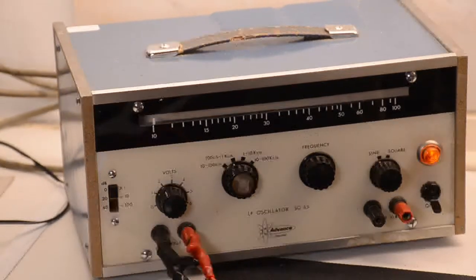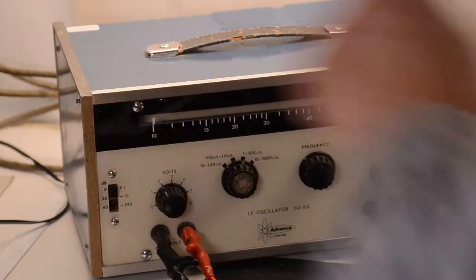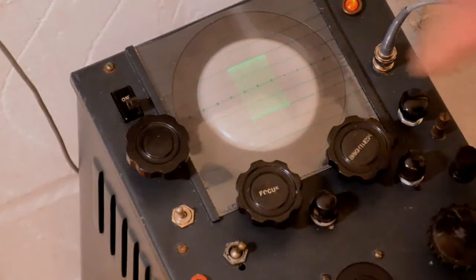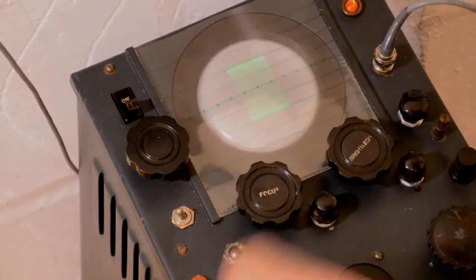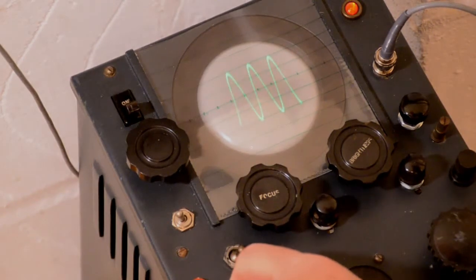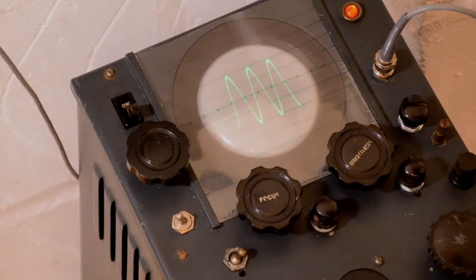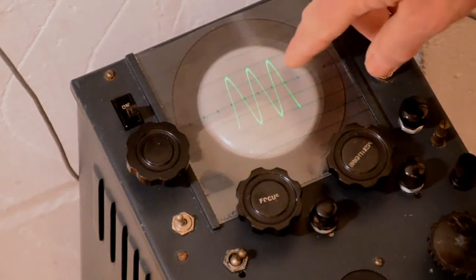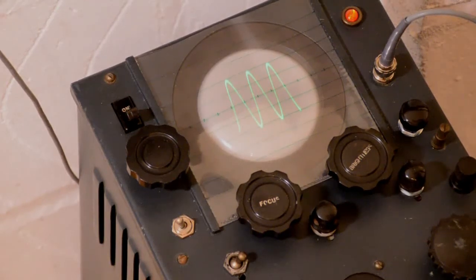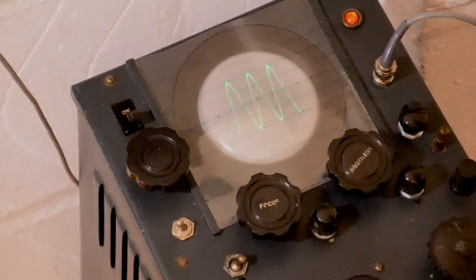Okay, that's 100 hertz — let's change that to one kilohertz. One kilohertz is showing on the scope, so we need to change the time base setting. That is our one kilohertz waveform, once again through the amplifier from the oscillator — one, two, three, four divisions. So 100 hertz and one kilohertz are giving roughly the same amplitude, which means that the frequency response is relatively flat.